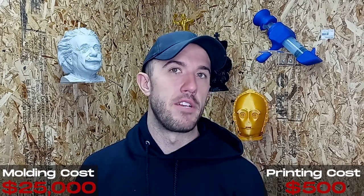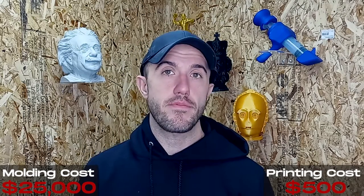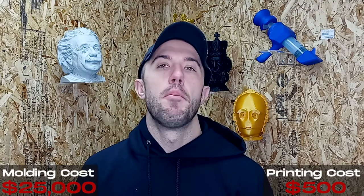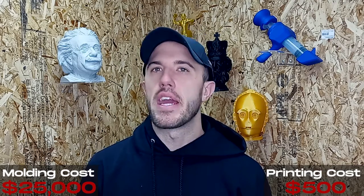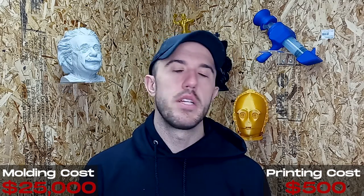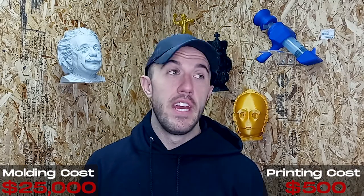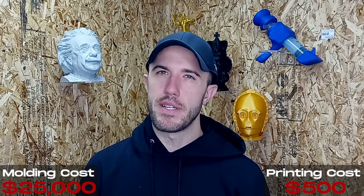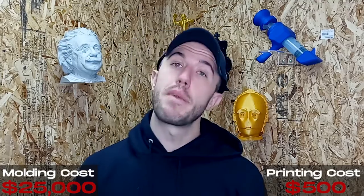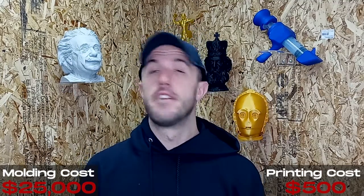On this project you're only out $500, whereas with injection molding you would be out $25,000 if nobody buys your thing. With 3D printing you'd be out $1,500 at most. We're already way better. Now let's actually scale to 10,000 parts. If you're making 10,000 parts with 3D printing, you have eliminated the $2,000 to $10,000 mold cost right off the bat. If the mold gets bigger it gets more expensive — it's not uncommon to have molds that cost $100,000.